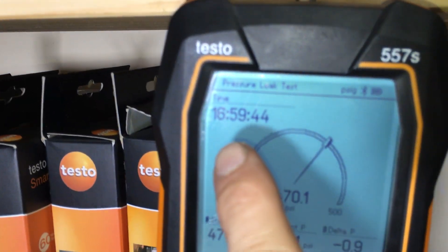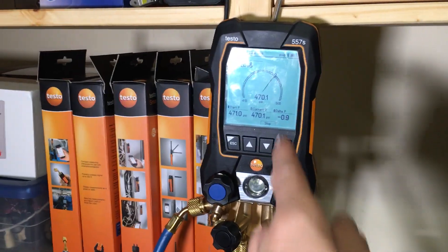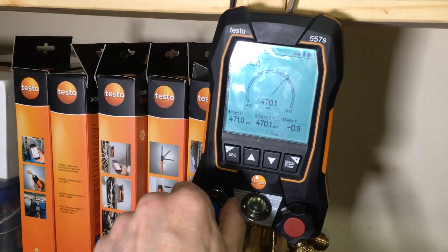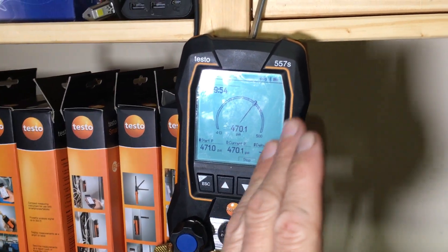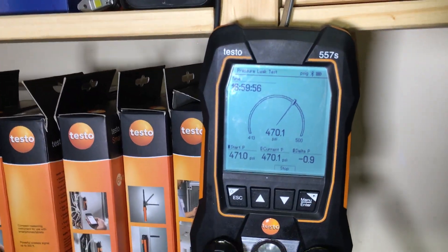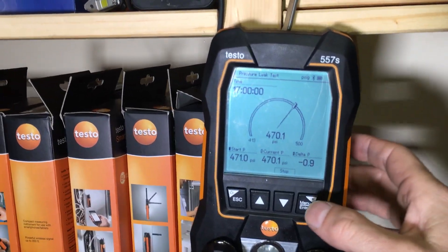It's been 16 hours and 59 minutes since I pressurized this up. It still has pressure — both of these gauges are closed right now. Let's go into the other measurement system of the high and low side, as if you were going to take a pressure reading.